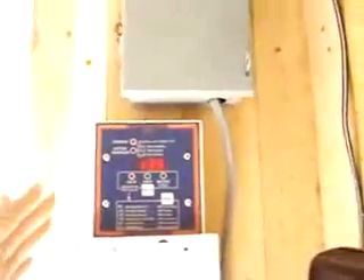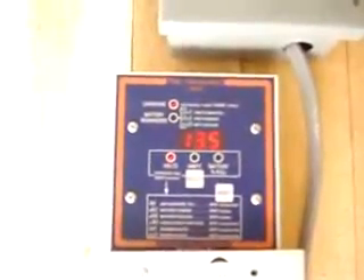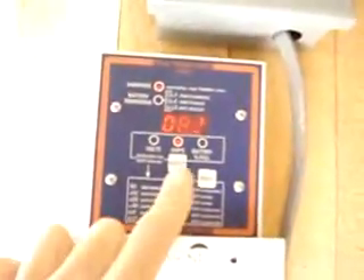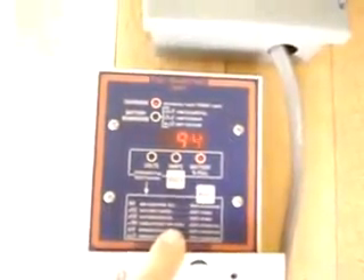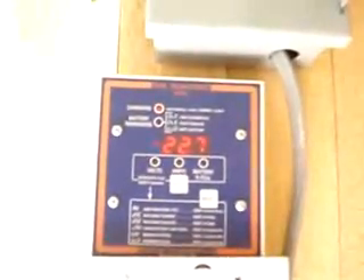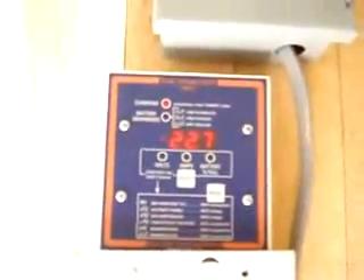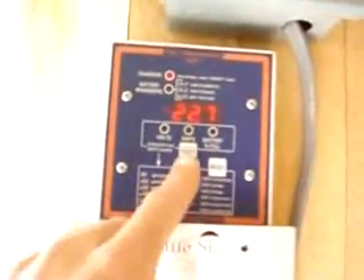This action here is just a monitor — basically giving me every piece of information I could ask for. Right now my current voltage is 13 and a half, current amps coming in is 8.2. My battery is currently 94% charged. This is amp hours from full — currently I'm 22 amp hours from being completely filled. As this juice comes in that number obviously drops until it's down to zero.